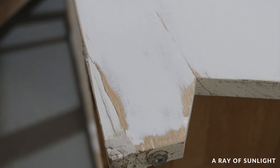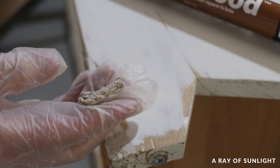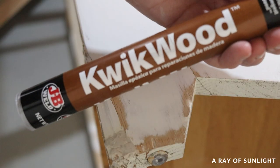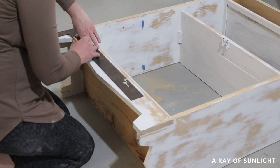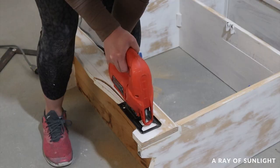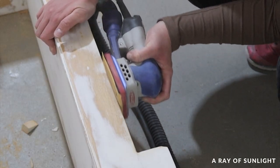There are so many things that you don't notice until you start working on a piece of furniture. While we were sanding, we saw that the back leg was a little bit damaged, so I filled that damage in with Quick Wood. I wanted this cabinet to look more modern and less primitive, so I marked some straight lines and cut the V-shaped base off with a jigsaw. Then I sanded it to make my rough cuts look straighter.